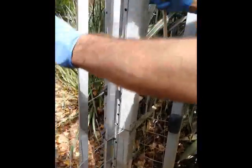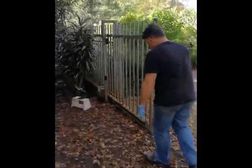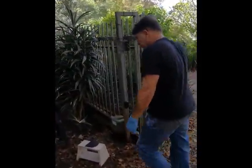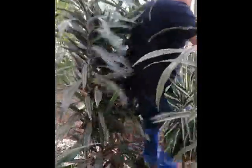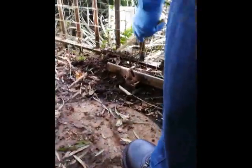Push the gate all the way and make sure that it runs through the door. You can have a look at the gate from the back. Make sure your gate has an end stop before the gate runs out of the guard rollers on the other end. Your end stop has to make sure it stops the gate before it runs out of these guard rollers for safety reasons.